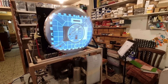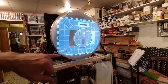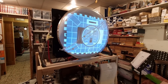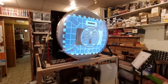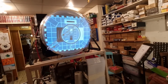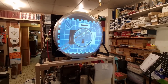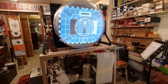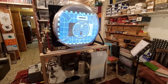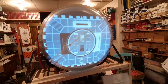So there she is — the 1938 Baird T18 doing its stuff. There's a bit of hum I can still notice on the screen. I was assuming that was going to go when we did the smoothing capacitors, but it's obviously going to be some cathode leak on a valve, or a wire too close to somewhere it shouldn't be. But you can see that's a pretty good test card C for something from 1938. It's not going back in the cabinet here — it's going back to the customer. I've got a little bit of fettling to do to sort this hum out. That's pretty much where I'm going to leave this video. Thanks for watching — I'll just leave you with a bit of a hummy test card C.